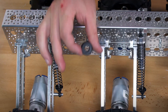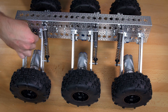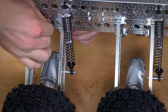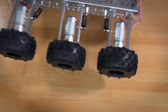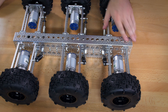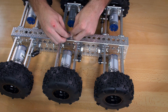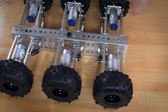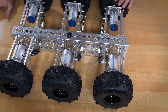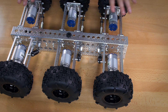Finally, your kit comes with rubber grommets. Place them in between each of your wheels — they slide into the half inch holes on the actobotics and help protect your wiring. Because the kit is made out of actobotics it's completely versatile, so you can place them in any of the half inch holes on the channel. You might place them in the bottom between your wheels and route all wiring through one hole per set of wheels. The kit comes with six grommets, and you can get more if needed.